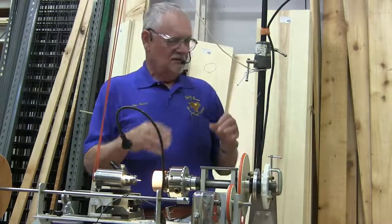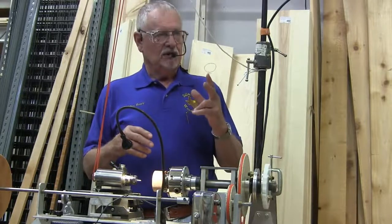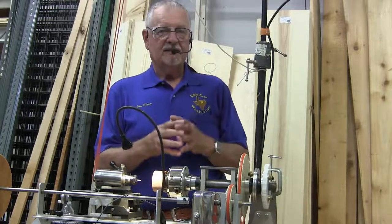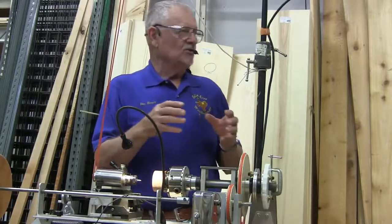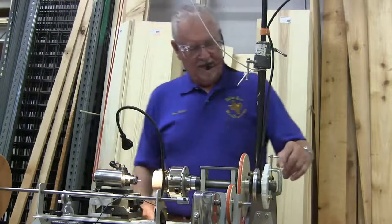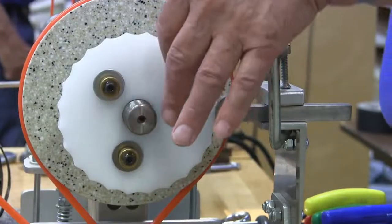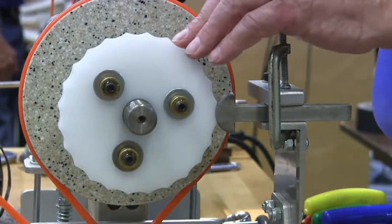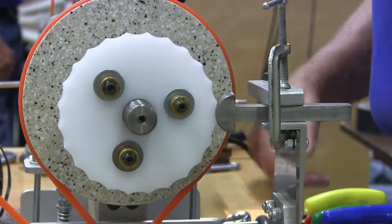The way they match. When John McGill first made his MDF lathe, it came with two rosettes. One was 12-bump, I believe, and the other was kind of a square. They said if you used all the different combinations you could possibly do, it would take you several years to do them all. It was just that many complications. You can also put a flat rubber on the end here, and it just goes across the bumps. It's what they call fading, where you're not allowing the rubber to go all the way to the bottom of the rosette. There are numerous different things that you can do.